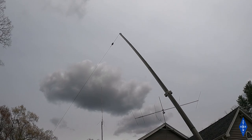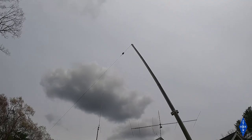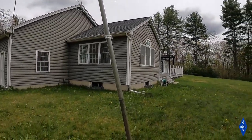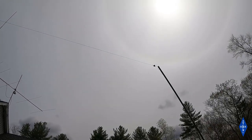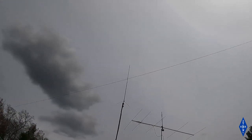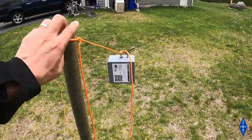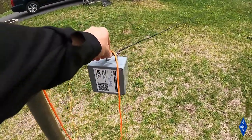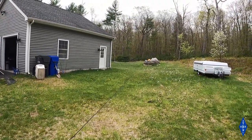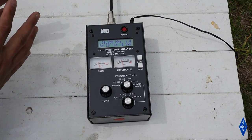Here's a brief look at how I've got the antenna set up for testing. I've got the far end of the antenna up about 20 feet on surplus military canopy poles. This is the full length of wire supplied with the kit — about 69 feet or so. At the feed point end, I've got just one four-foot section of pole with a piece of rope for support. I'm going to use my MFJ-259 analyzer on the antenna before I trim it, just to see where everything is at.